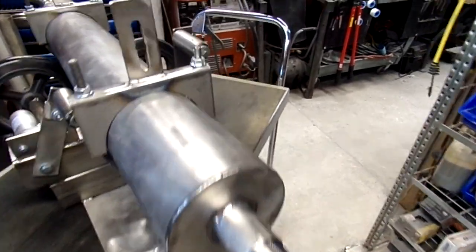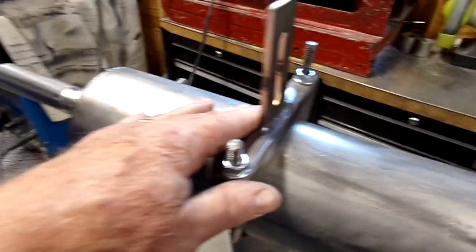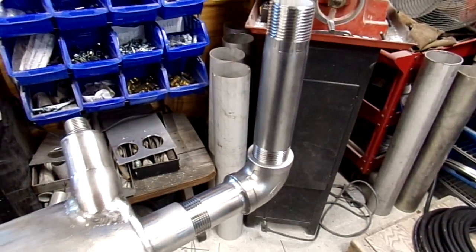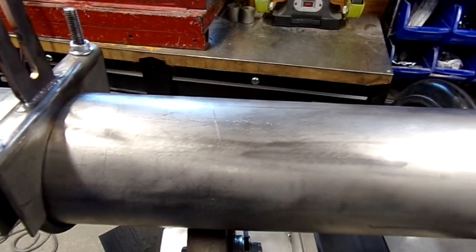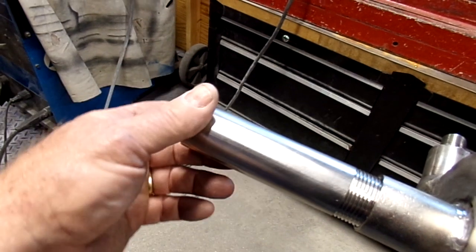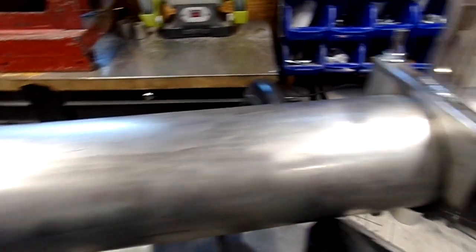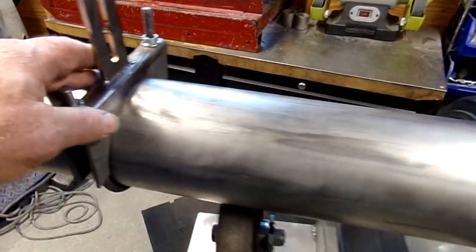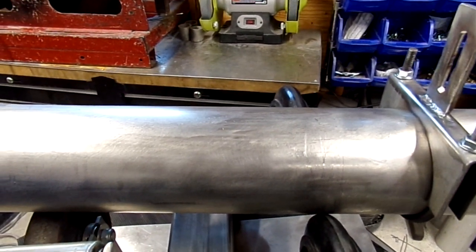Here we have a post heater or preheater, depending on how you want to phrase it, in reference to the heat that comes in from the rear and then feeds through 20 feet of high pressure, 3,500 pounds pressure rated coils of 40 feet, comes out and exits out here through the panel and the hole on the bottom of your machine. 15 years ago when we started building Blue Baron, we had two divided heat exchangers, and one was for a post heater and one was for a preheater.